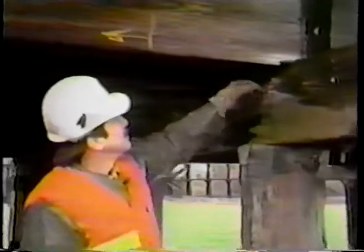While we're here, I'd like to show you that this moisture coming through the deck in this crack above my head here, that's where the expansion joint is. It allows the moisture to run down across the stringer, stand on top of the cap here, and you can see moss growing on it, and that's another indication of rot. And this white stuff here is a good indication that's a good place to start rotting. If we have a weather check or a crack up here, water will seep down into this cap and it'll stand there and eventually rot. I can see by looking at this right now, we have crush starting in this cap. It's where the weight of the deck is coming and pressing on this cap and it's pushing it together. That's a bad sign. It's a good thing we're here to change this.